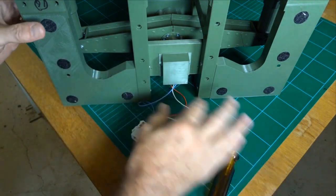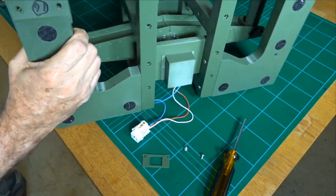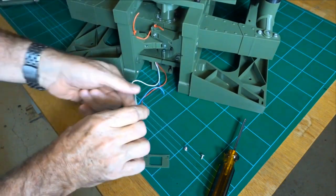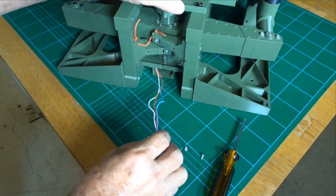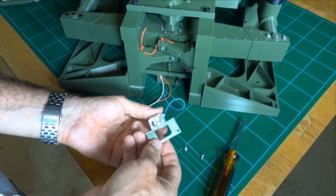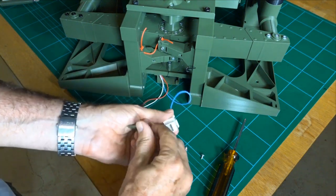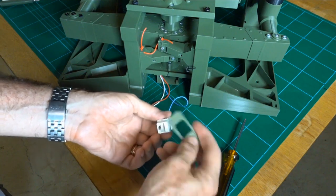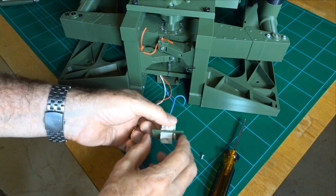Okay, so that's attached now. The wire exit from the Maghall is covered. Now we have the wires hanging at the front. There's an excess of wires here, so you don't have to worry. You could trim a bit off if you really want. Okay, you do your attachment to the RJ45. You then have this cover plate with the little recesses at the back. So that goes all the way around, together like that, clips in.